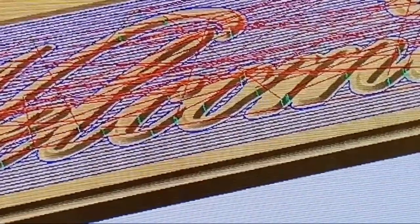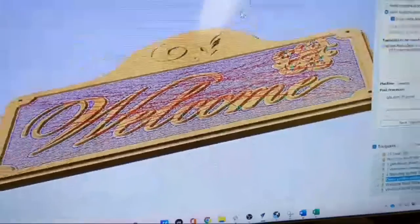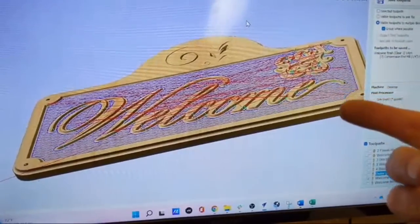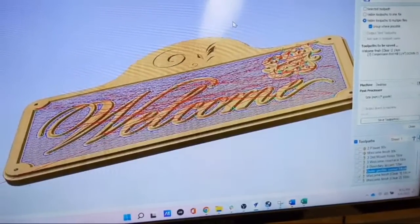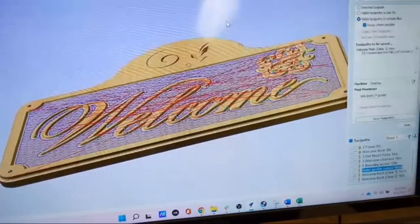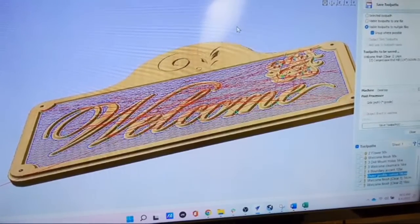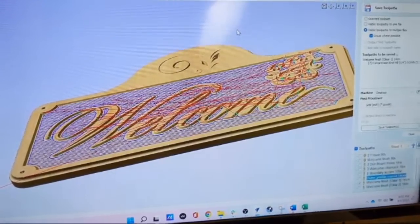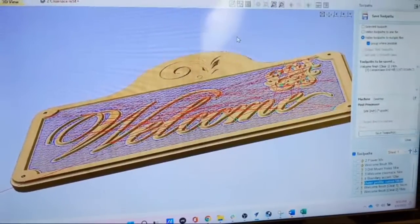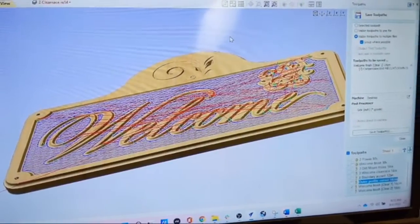Army Dogs Creations. So what he'll do is he'll use the eighth inch bit first and just kind of clear out and then go to his V bit. And his intention is to use the less expensive bit to do his clear cut and then come in with his more expensive bit and save the bit. And we can afford to lose the eighth inch better than we can afford to lose a V bit because the price is so much different.